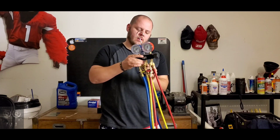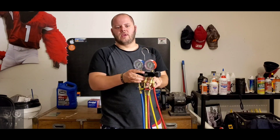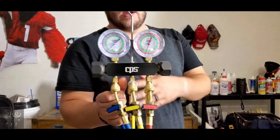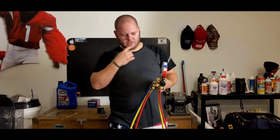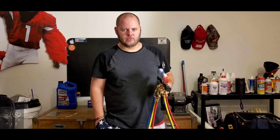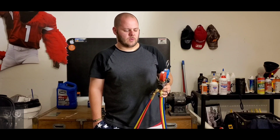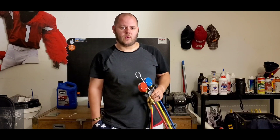Then crack your service line — the yellow line — and it releases all the excess de minimis refrigerant. This sets both your high and low side of the manifold to zero for the next usage. Sorry this was an impromptu addition — I didn't want to forget it or half-ass it. I want to be concise, clear, and honest. Thanks for watching — post questions and comments below.